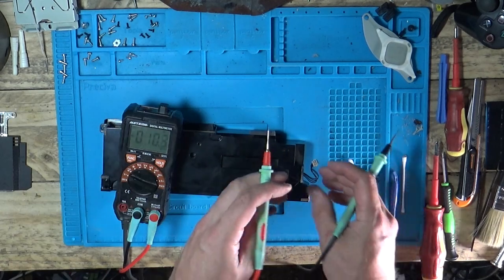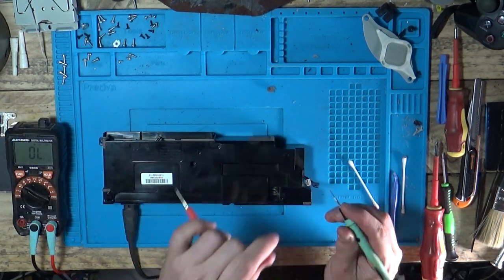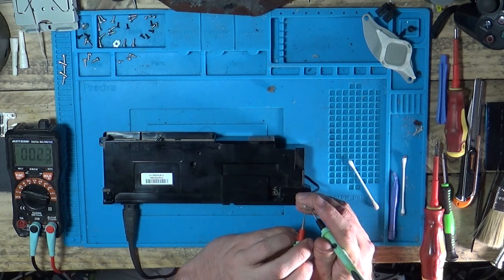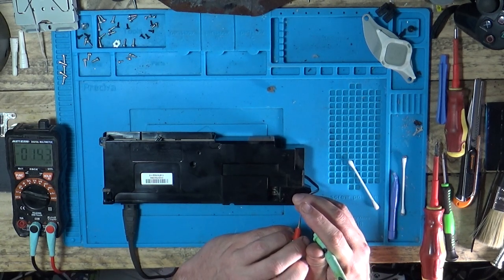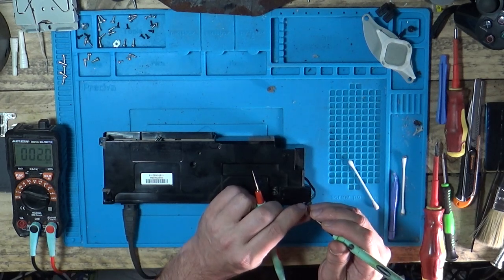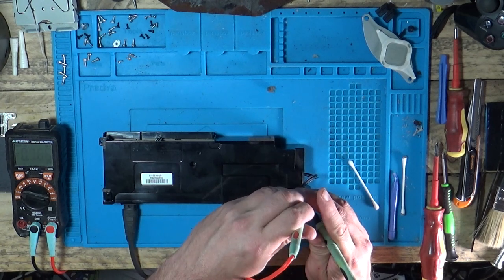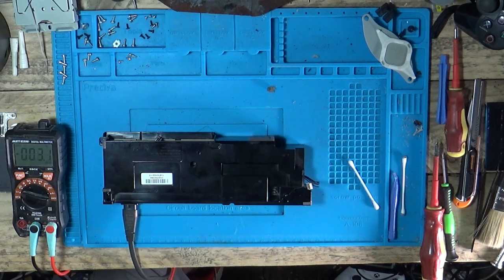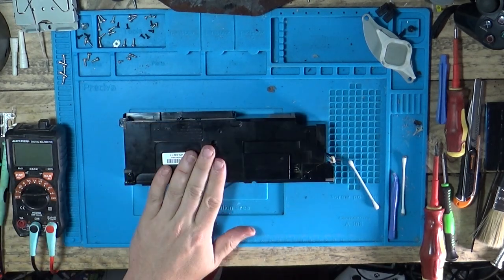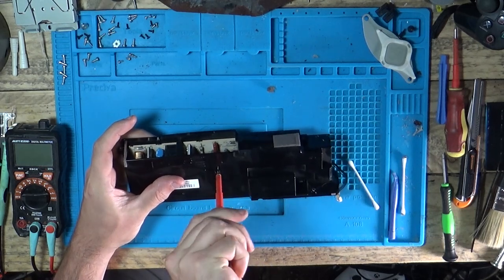This is powered up. I'm going to test on here — we should get our five volts. I'm not sure what pins they are. I think that one may be ground. Let's get the volts DC. Nothing. I'm not sure I'm getting anything out of this power supply at all. You should at least get standby or some voltage. Right, I'm going to take this apart — be very careful taking the power supply apart, especially when it's just been plugged in, because some of these caps could be charged. They hold a lot of voltage and power.